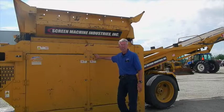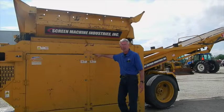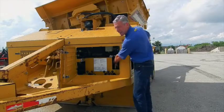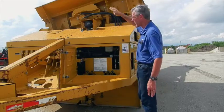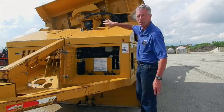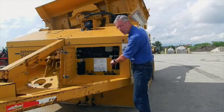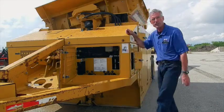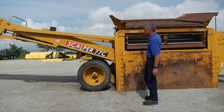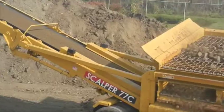Under these two panels there isn't much, but it gives you access for service: tensioning the lower screens, taking them out, changing them, or checking the tension. The couplers inside are used to change the rotation of the upper hopper — either forward rotation or reverse rotation, which throws the material back up on top and gives it a longer hang time. You switch it easily by uncoupling those couplers, switching the hoses, and coupling them back — depending on which direction works best for your application. After processing through the shaker box, the material drops onto the conveyor.